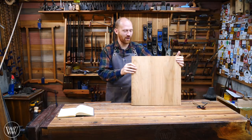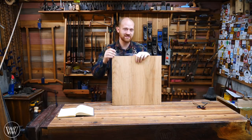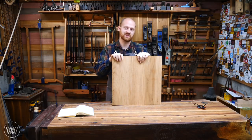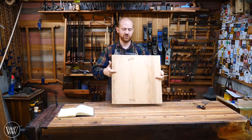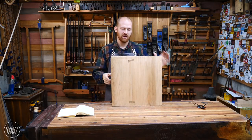So we really want to go through this. The top on this needs to be 18 inches by 18 inches, and I thought I had one piece that would work for it, but alas, I did not — it was 17 inches. That means I'm going to have to join two pieces together. But I want to build this whole build without any glue, so I'm going to have to get creative. For this top, which I've already finished, I'm going to be tongue and grooving and then putting in butterfly keys.